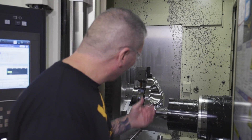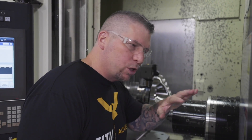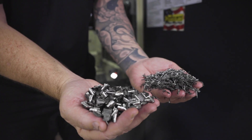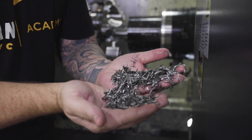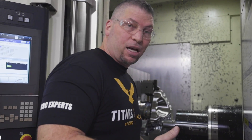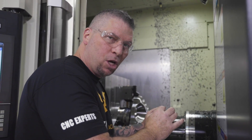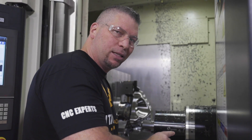Look at that — you can just see it taking shape. It's absolutely beautiful. Later on we're going to come back with a ball mill and surface it so it's gorgeous, but I actually like it like this with all the different steps. Just stunning. On the last tool we had big chips, but this tool — because of the chip management, meaning the chip splitters and the design — look at that, they're nice and tiny. Little happy chips. The only reason we have chips down here is because I'm not using the flood coolant or top coolant — I'm leaving everything off for filming purposes. Once we're done, we'll remove the chips, flush it out, and clean up the machine.